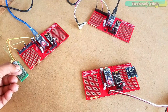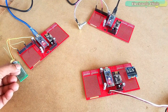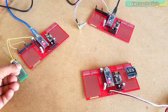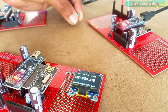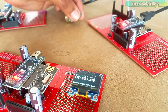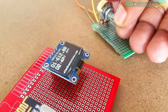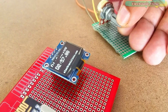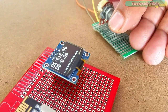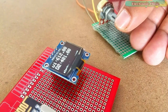The question is how Arduino knows this. It's very simple — along with the sensor value, I also send the header value. The header values of both transmitters are different. I'm using a header value of 231 for transmitter number 1 and 434 for transmitter number 2. These header values remain constant throughout the communication. I will explain this in the programming section.